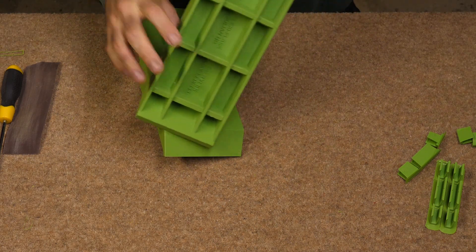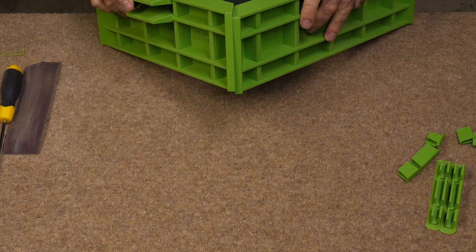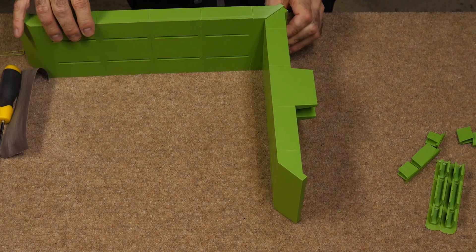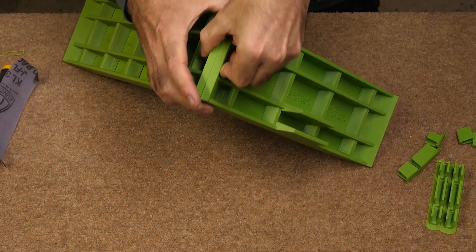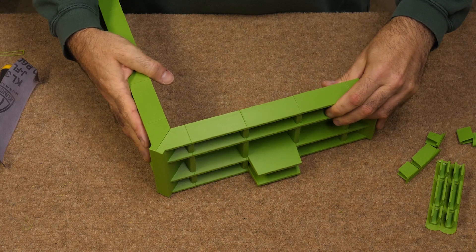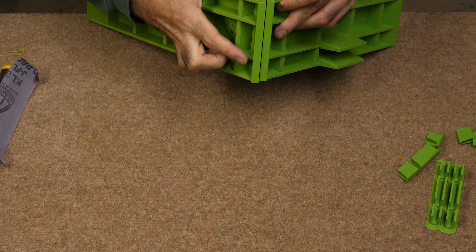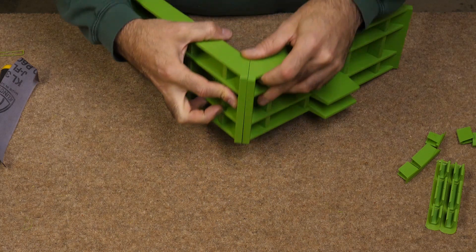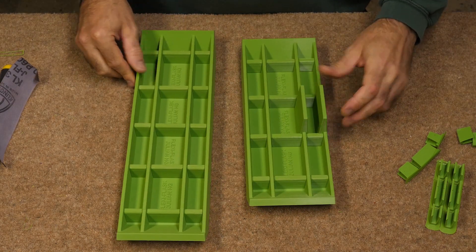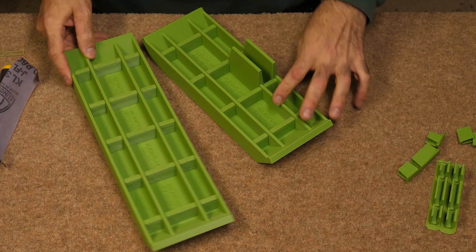I've got some really cheap low-temperature brazing sticks which might work well, but given the low-temperature aspect they might also melt during a casting, which would be very bad. But they might be good to join the sides together to help with drilling the holes or welding, perhaps. Until I actually try to do these things, I'll never know which things are rubbish and which are showing promise and deserve further development. Maybe the clips won't survive the stresses of the mould making — who knows?